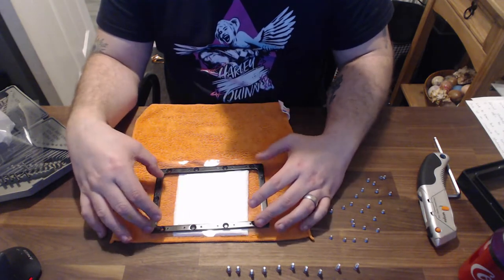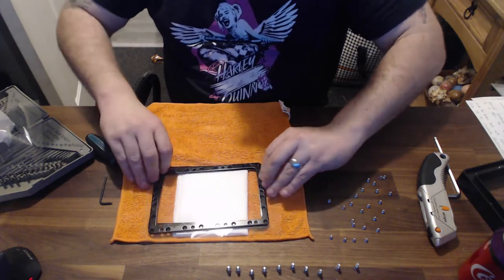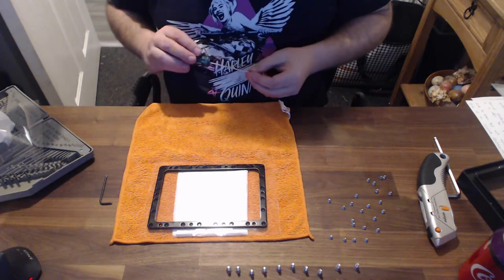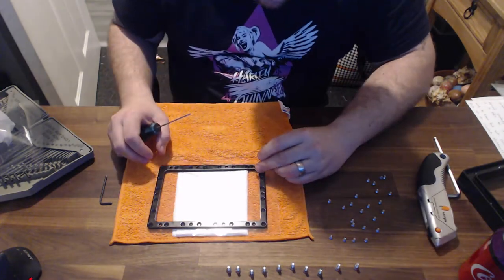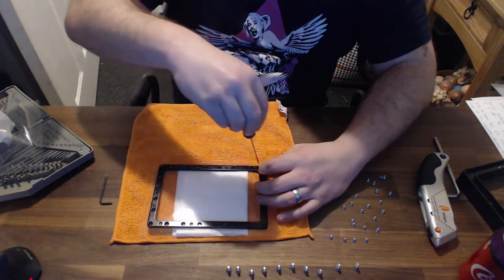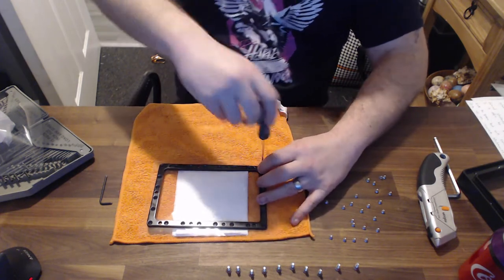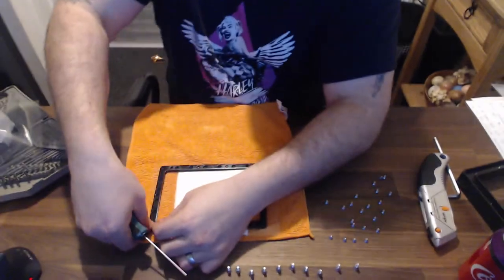Now it's literally just to get it all lined up, and then I'm going back over to the other side where there are the multiple screw holes and I'm just going to line it up and screw all of those tiny little screws back in. These go in fully tight — you don't need to keep these ones loose at all. Just tighten them up, maybe do one corner at a time. A little bit of pressure and they pop straight through the FEP. I've seen some people use a punching tool to make the initial hole, but I find that you can make the hole and it doesn't quite line up properly.